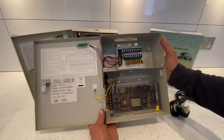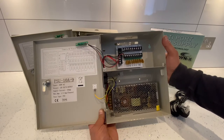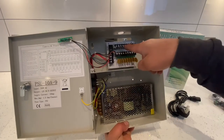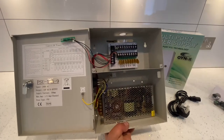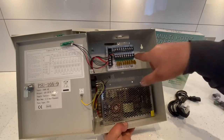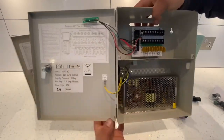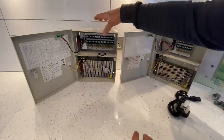I've used these for a couple of years and they're excellent. If you've got eight cameras, having an extension lead with eight plug sockets creates a lot of heat and hassle — this consolidates everything into one unit. All nine outputs are individually fused via PTC, so if one trips it won't take out all your cameras. On a power surge, it trips and then automatically reconnects. Each channel also has an LED, so if a channel goes down you'll immediately see which one has the fault.